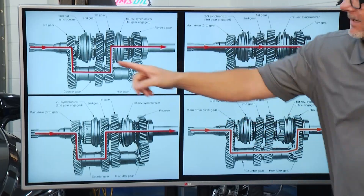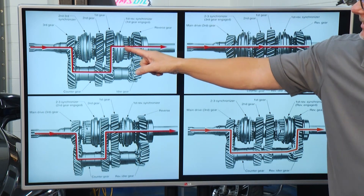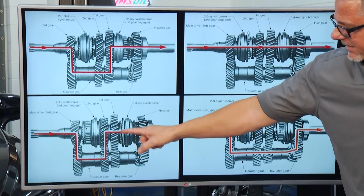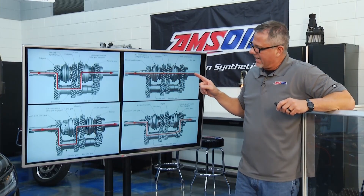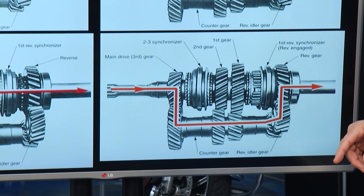You can see it right here. This is actually coming down to a counter shaft and first gear — it's a little gear driving a big gear. I'm getting a massive amount of torque. Then in second gear, it's a little bigger to a bigger. I'm getting second gear, third gear, direct drive — what's going in and what's going out. And then there's reverse right here.